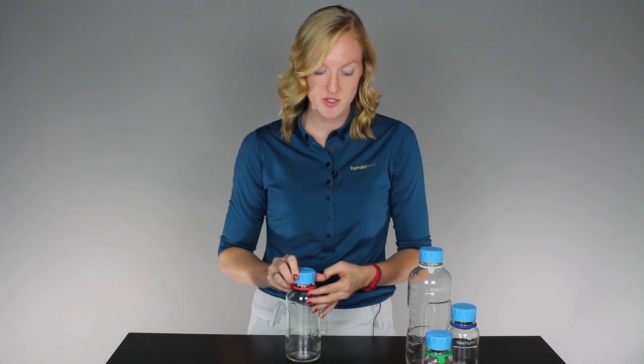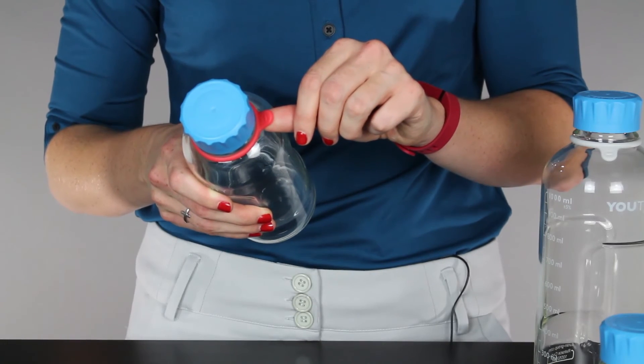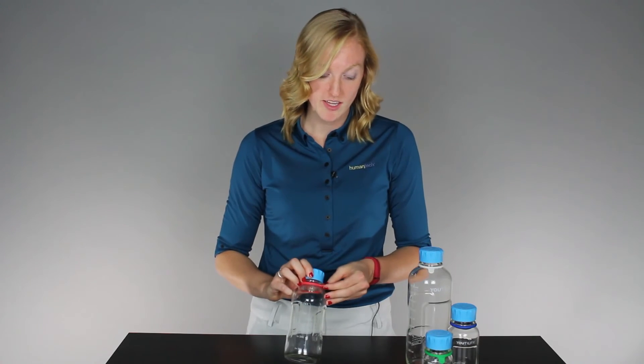The tab on the tags should be a little bit bigger — at least 0.6 inches — to accommodate your thumb pad width. Additionally, the clearance between the tag and the bottle should be at least 0.75 inches, and ideally it should take no more than 4.8 pounds of force to remove the tag from the bottle.